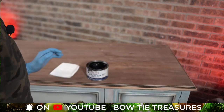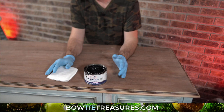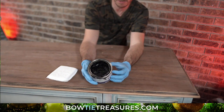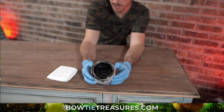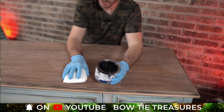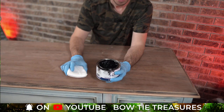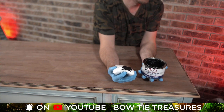I'm going to say right off the bat that it was a lot easier to stain that project because the tops are so small. The disadvantage here is I've got to work across this piece really fast. The instructions talk about applying a generous coat of gel stain and wiping it off with a clean lint-free cloth to remove excess stain. I won't be wiping off excess stain because my goal is not to have any excess — I'm going to rub it in and keep moving. Do you see how much I put on the rag? Just a dab of it.